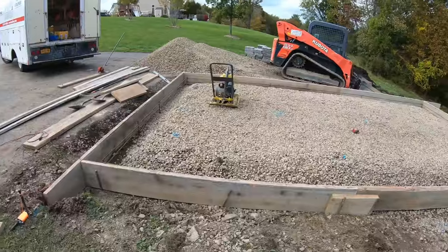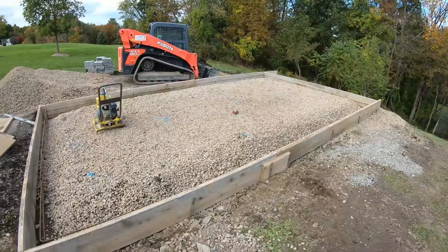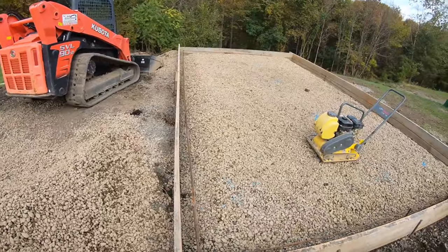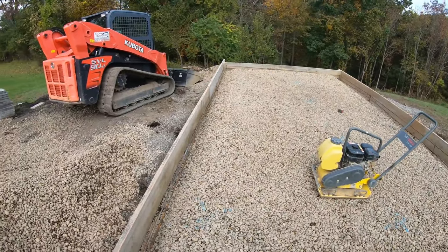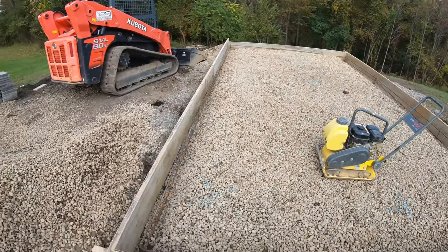So when you're doing these Alaskan slabs, and this is only a 12-inch haunch, when you do a 2-foot haunch, you best have your game on. Now, Carl, you could admit, I was the first one to show you about the preload. You called me crazy. But like I said, it works. So what's next is get the tamper out, put wire in it, put stone all the way around it, and we'll be ready for inspection.